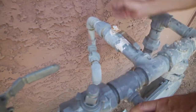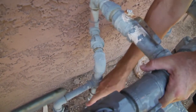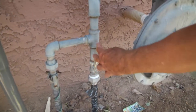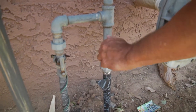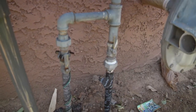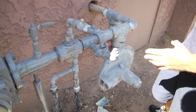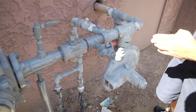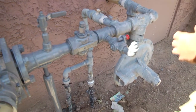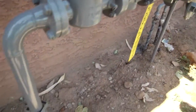Here's where the gas is going down into either a boiler or somewhere remotely, so there are handles down here for both of these. Even though it's a different style handle, it's in the parallel position on both pipes. If you were to turn it a quarter of a turn, it would be perpendicular to the pipe and you would stop the flow past that point. So there's a third type of handle you might encounter, but the way to shut it off is the same: parallel to the pipe means flow, perpendicular means shut off. If you're not sure where all this goes, the best thing to do is go back to the main where it's coming in and shut it off at that valve.